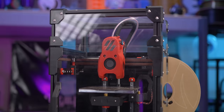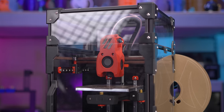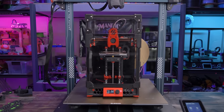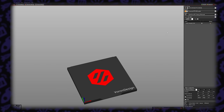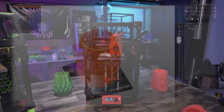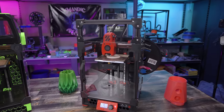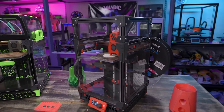Simply put, there are plenty of legitimate reasons why one of these little machines may not be for you, but I hope I showed that the build volume limitation is not as big of a hurdle as a lot of people think. Maybe you could rethink how big a machine you actually need. Don't just take my word for it — download PrusaSlicer if you haven't already. It's got profiles for Voron Zeros in it. Load one up and start slicing models. You can check out print time estimates, which I find fairly accurate, and see the build volume limitations for yourself. I quite like these little printers. Maybe you will too. Oh, and why am I bald? Well, I'm not — I'm taller than my hair. Also genetics, and generally I'm older than people seem to think. Guess in the comments.